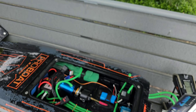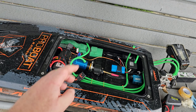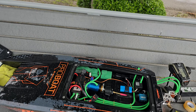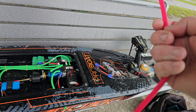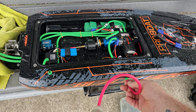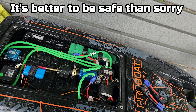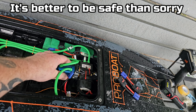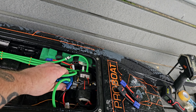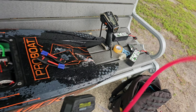Nope, I'm going to put 12s on it. I'm going to take it easy and wait about 20 minutes before I run it. I'm actually going to go to the car and pick up a water bottle and squeeze some water in there to cool that motor down. Got my batteries in, went to the truck for my water bottle — just gonna put it in here and squeeze some water through it. It's coming out the rudder, just trying to cool my motor down. She's at 83 — that's good.